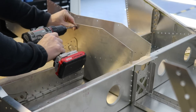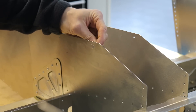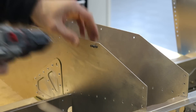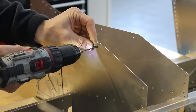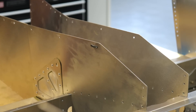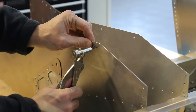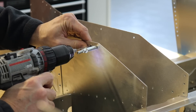Moving on from the seats into the fuselage. Again, the same thing I did with my cruiser — this center armrest part here, I'm not riveting the tops on. What I did on my cruiser and what I'm doing here is mounting nut plates on these pieces so that I can remove the top parts if I ever need to get in there to check wiring, lube the torque tube, or whatever — especially once a year for inspections — instead of having that top piece riveted on. All I'm doing here is drilling out the holes for the nut plate, with the nut plate mounted on the outside just to drill the holes.